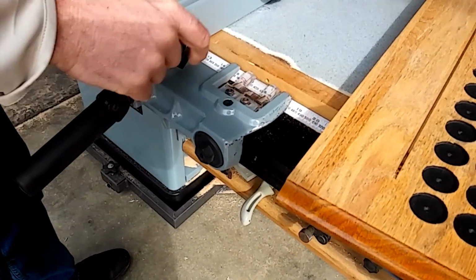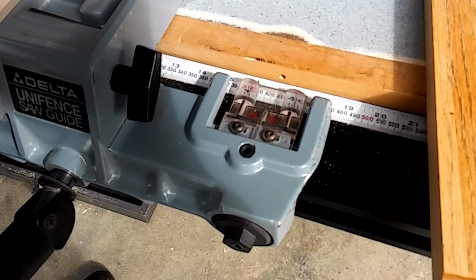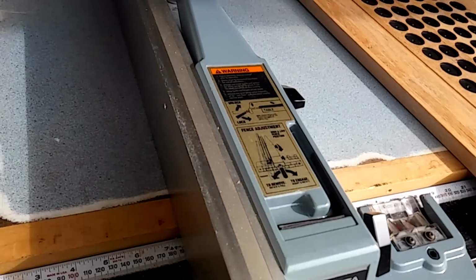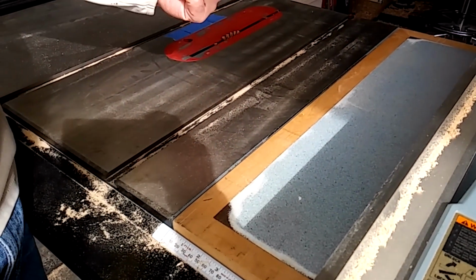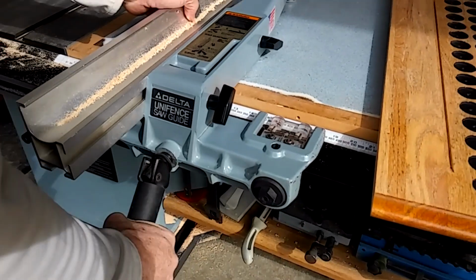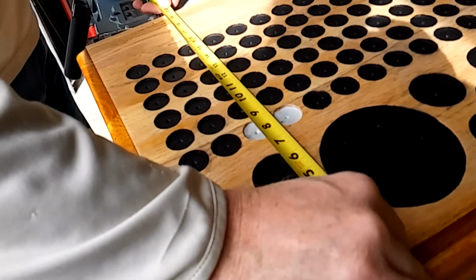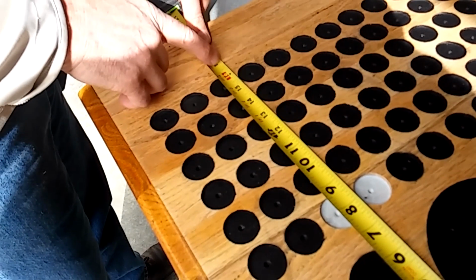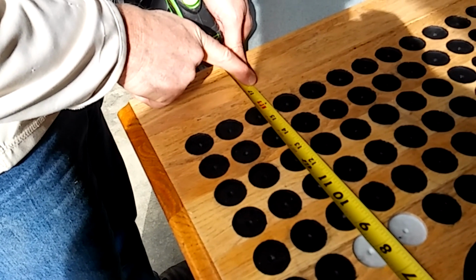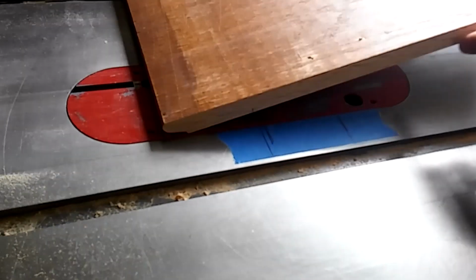This is a vernier scale. So this line right here says 17 3/8, and this line is exactly from the fence edge to the kerf, the tooth that points over this way. Right, so then it doesn't just rip it apart. This one's at 16, the top of it's at 16 3/4, and the next top of it would be 17 3/8. It's right there. Yep. Line with this and this line with that one.